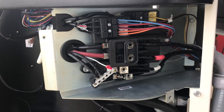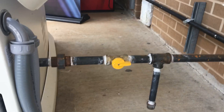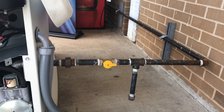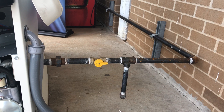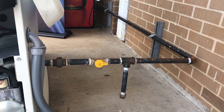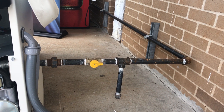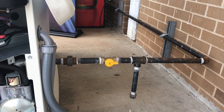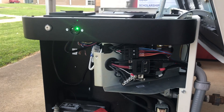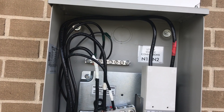The gas line — I don't know if this is too small. The Generac technician, Mr. Dean, I think he does servicing for this area. We needed an inch-and-a-quarter pipe for volume if running heavy loads, and we've only got a three-quarter pipe. But we're just basically running lighting here — we're not going to run anything else — so other than that we didn't have any problems. We've got our grounds and neutrals, and there are our hots.